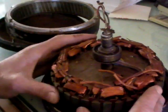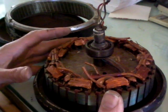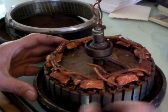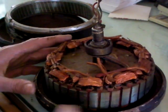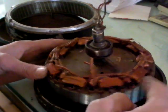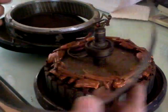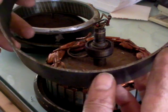This is all for fun, to see if it works. It will work with block magnets and will be even better with arc magnets. If we can prove it works with block magnets, for sure it'll work better with arc magnets. Once I rip this off and recoil it, I did this little piece of steel sheeting — maybe a sixteenth of an inch, just a little bit less than an eighth — for the rotor surface.